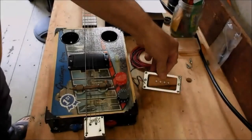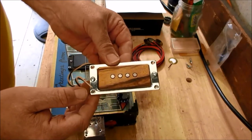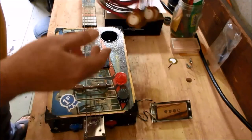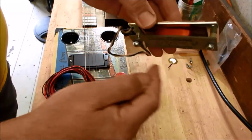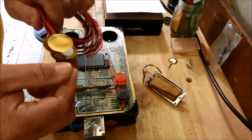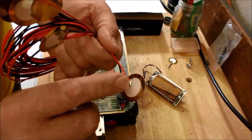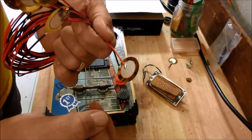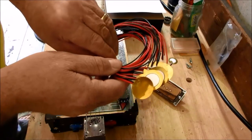You'll remember a couple of videos ago I did one called 'How to Wire a Coil Pickup.' This time we're talking about piezo. The coil has magnets surrounded by wire with two leads. The piezo is just a brass disc with a piece of ceramic on it — a hot or red wire onto the ceramic and a ground or black wire to the edge of the brass circle. Buy these in bulk if you're going to make guitars, it's a lot cheaper.